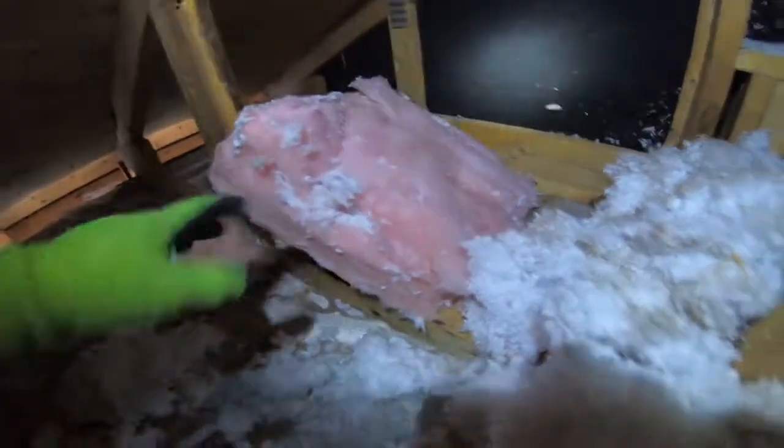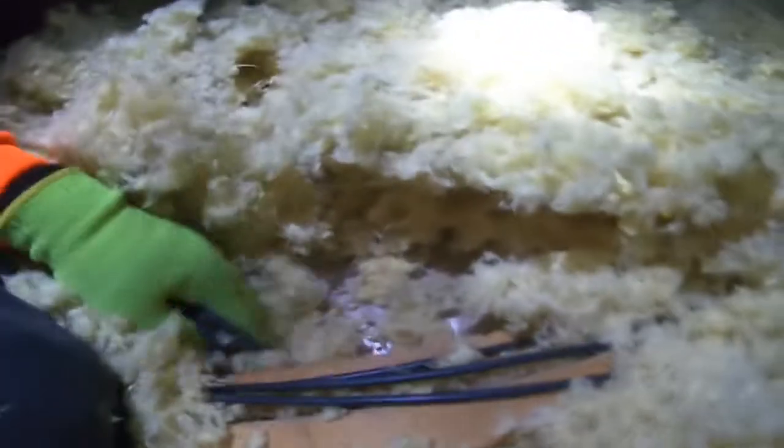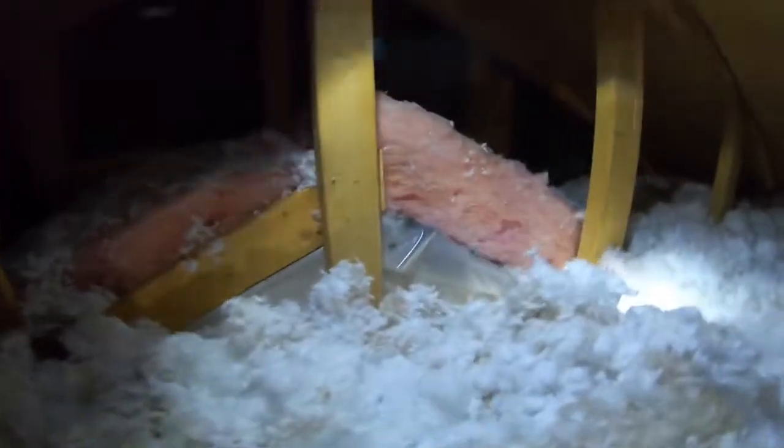The best top-up would be to remove the old insulation, especially if it's no good anymore, and to put a spray foam of two inches, put a vapor barrier down, have no air leakage whatsoever, and then continue with the spray foam. A lot of people say just straight up do spray foam — even half pound over top of the two pound — so you've got your vapor barrier and then you've got your bigger R-value.